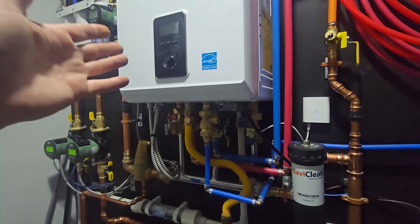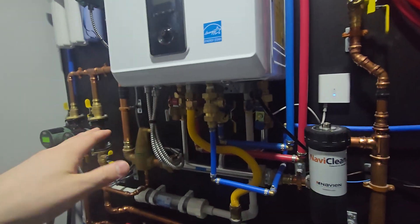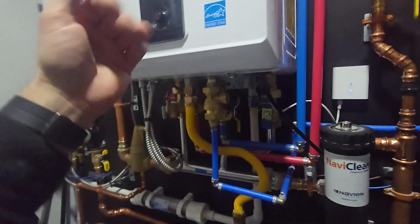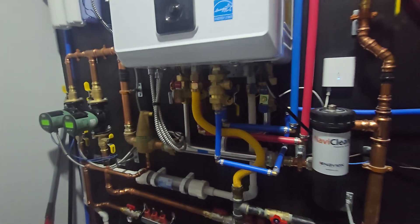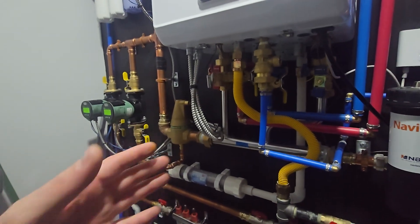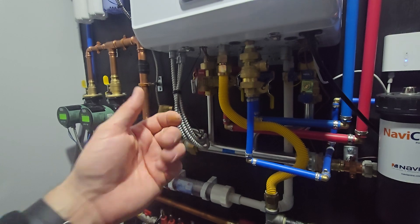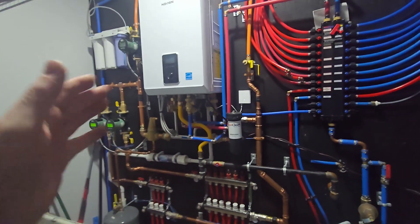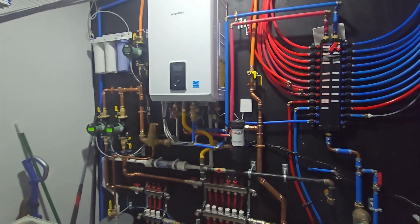In this boiler, if it shuts off and then some air bubbles move around and that pressure drops, it's going to open again and allow that full 55 or 60 psi to enter. When it feels the resistance and hits 12 psi again, it's going to close. So the point is that it's going to automatically regulate the pressure at 12 psi.